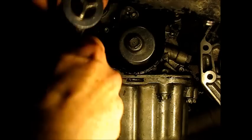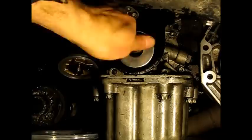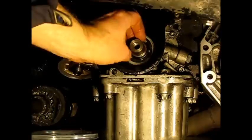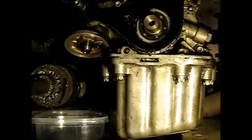Putting the finishing touches on now. I had to take the setting tool in and out a couple of times just to make sure it's going in evenly — very important. It won't go in any further — you don't want to force it. It's in there. Just remove your kit and inspect it — it should be ready for reassembly. It's in there right and it should be even. Especially check the inner lip here. The outer is not going to have a problem — it's just a press fit into the bore of the engine. But the inner one, if you're going to have a problem, it's going to be there. If the edge isn't smooth, if there's a part that appears to be caught or raised, that's a real potential problem — you may have rolled it. This one now looks perfect. I'm going to call it good.